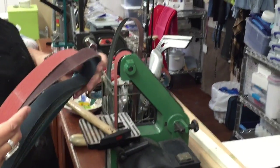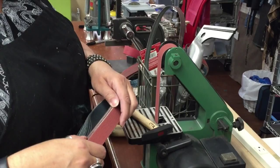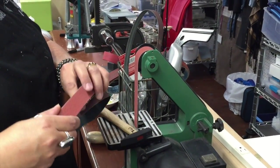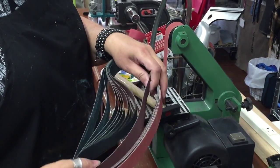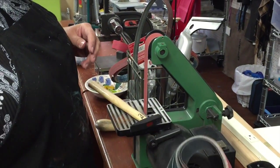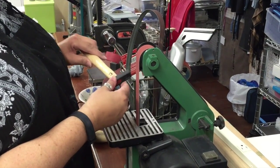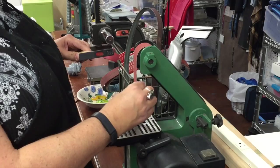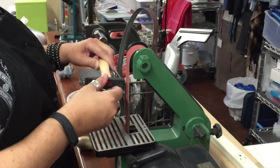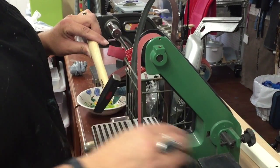So what I'm going to do is run it against the belt and work down to progressive belt sizes. These are ceramic one-inch belts that I got online. I'm starting with a 120 grit and I'm going to work down to sort of a cloth — I'm not sure this even has a number, maybe it's 600. Then we're going to move to some sanding papers to dress it up and make it look nice. I'm just going to work in this motion against the part of the belt that has some flex in it, and that will create a nice gently curved surface on this hammerhead.